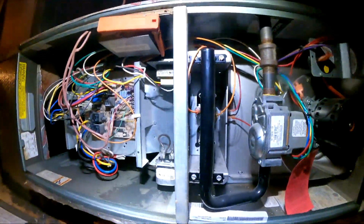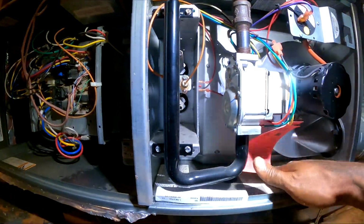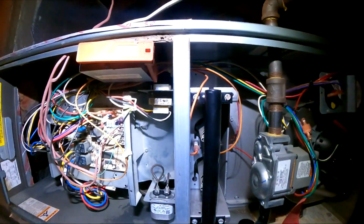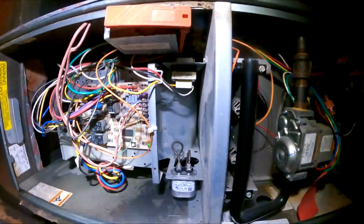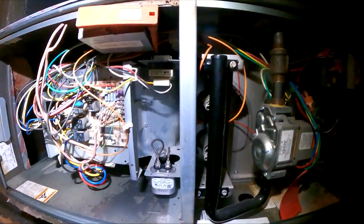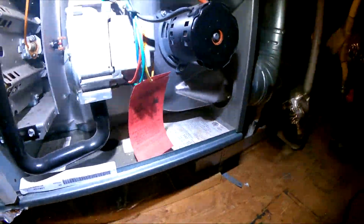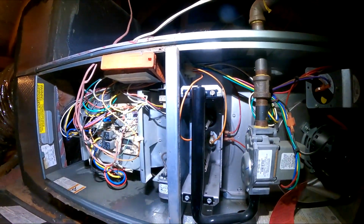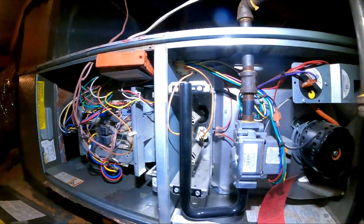I want to check these amps. I let the customer know, sometimes we replace these capacitors. Of course, I need to put the blower motor cover back on to check it. But I had known to replace the cap only, and a few days later, the blower motor goes out.